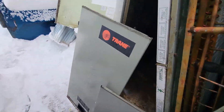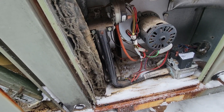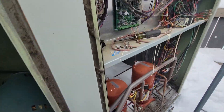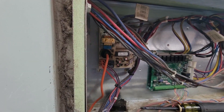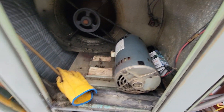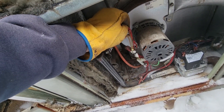Slow blinks, slow flash — normal call for heat. Let's pop this cover and see if we've got an igniter issue. It's been kept clean pretty good. It's either the pressure switch or the flame sensor, but I don't think it ever fires so it ain't going to be a flame sensor. Still blinking — let's check power on that pressure switch. It finally shut off — got two blinks. Let's get down here and see if we can get this apart without disturbing it.